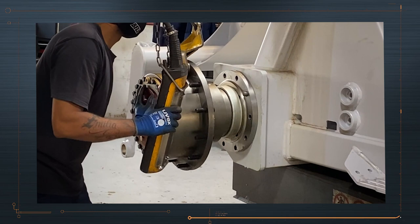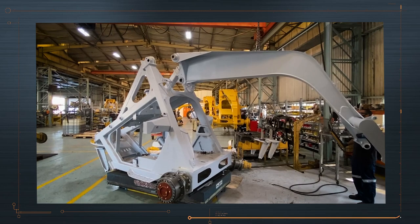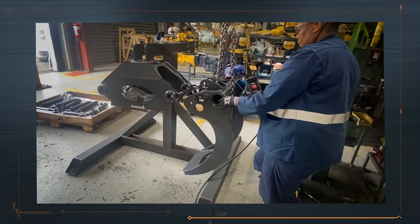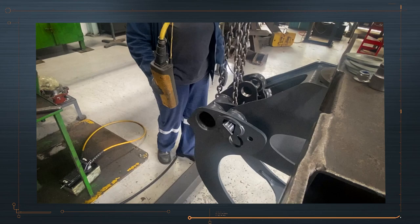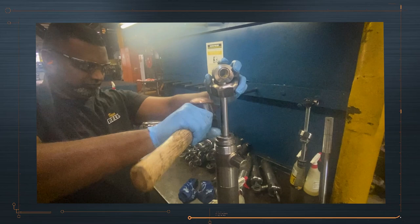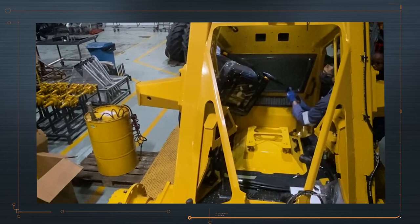The cylinders and other drive parts are also made in the factory. The rods of the boom cylinder, which is mounted on top of the machine to raise and lower the boom, are friction welded. During friction welding, the metal melts to create a perfect fusion of the parts. The grab is assembled with huge chrome plated pins being used to link everything together. Once the grab body is complete, the rotator which allows the grab to spin is bolted into position. Smaller piston cylinders that will control various other functions in the three-wheeler are assembled by hand, and the seat and other cabin parts, controls, and electrical system are fitted into place.